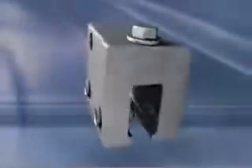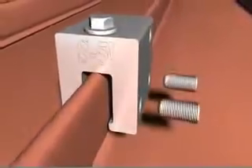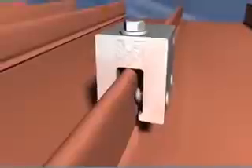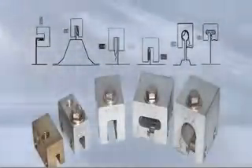The S5 Attachment Clamp is a serious solution to a real problem. The innovative yet simple design lends itself to a quick and easy installation process. It's made from high-tensile, precision-machined aluminum — not cast or plastic. It slides over the seam easily and is secured by tightening two round-point set screws with an electric gun. The set screws compress the seam material and lock the clamp into position. No holes, no goop, no warranty violation, and holding strength measured in tons. S5 has a clamp to fit every seam and profile.